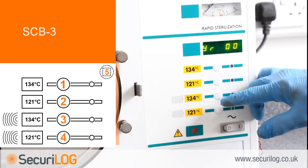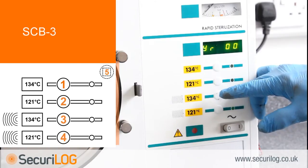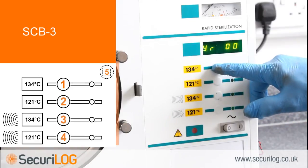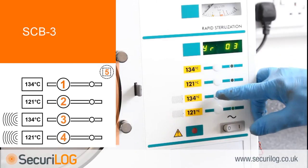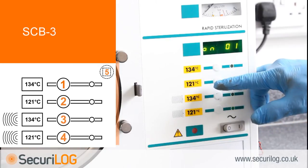The next part of the serial to be set is the year of manufacture, made up of the two last digits — so 2001 is 01. With the display reading YR00, press button 1 to begin selecting the required number. Button 1 increases the number, button 2 decreases it. When the number corresponds with the year of manufacture, press 3 to select. The display will now read ON01.